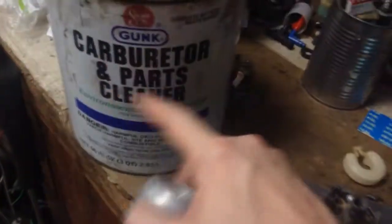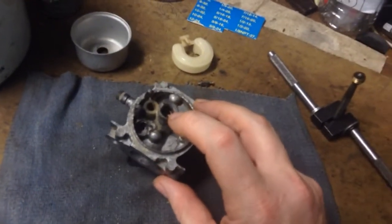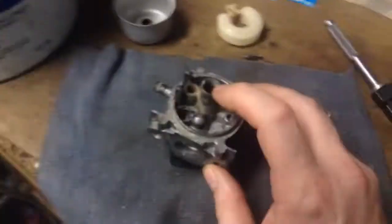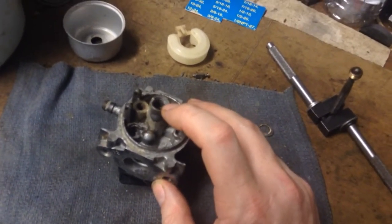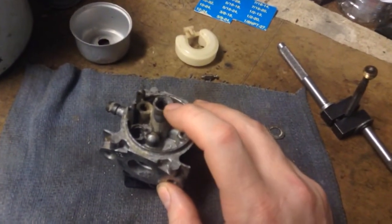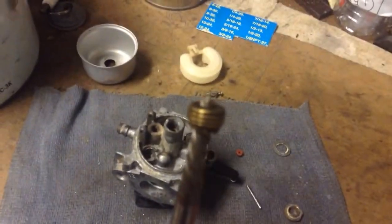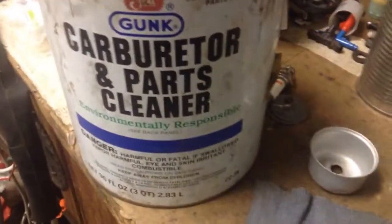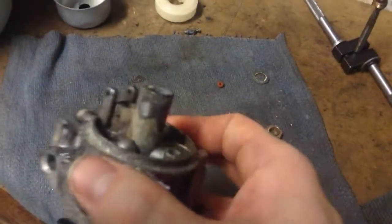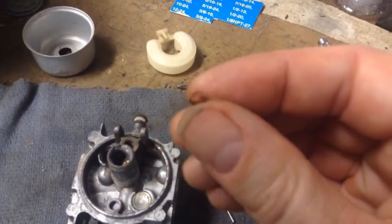I soaked it in this stuff — need to get a new can, that one's ancient and mostly empty. Even after I drilled it, there were still remnants in the threads — this is 3/8-24 thread per inch if you need to clean those out. A piece broke off seized up in there, so I drilled it out and used one of my smallest easy-out screw extractors. When I got all that mess out I still soaked it in the cleaner for a long time, but it looks better — it's still not usable.